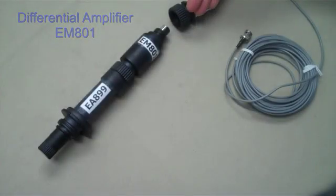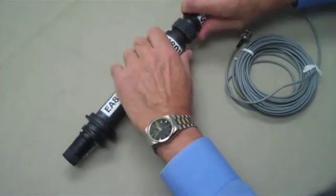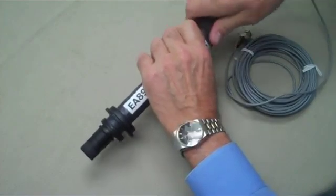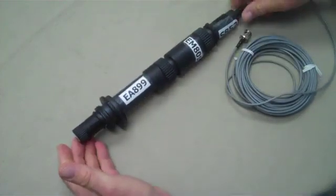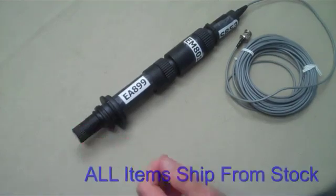At the same time, this protects the pH electrode from damage due to the floating voltage. Attach the S853 or S855 cap cable to complete the installation. This same configuration may be used for inline and submersion applications. Ground loops up to about 3,000 millivolts are solved using a standard, cost-effective pH electrode.